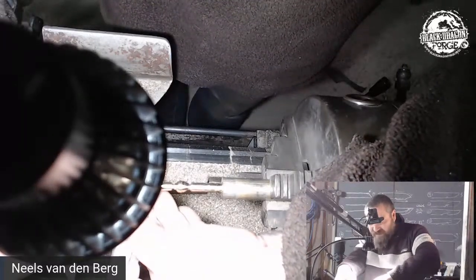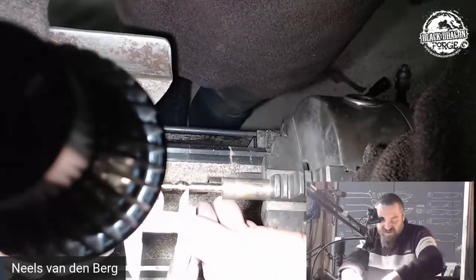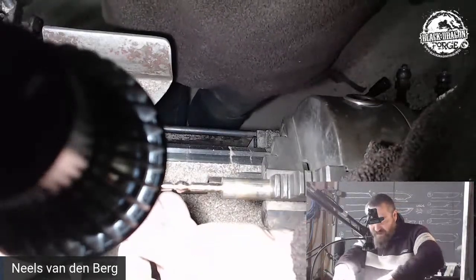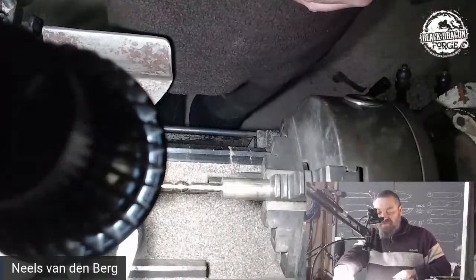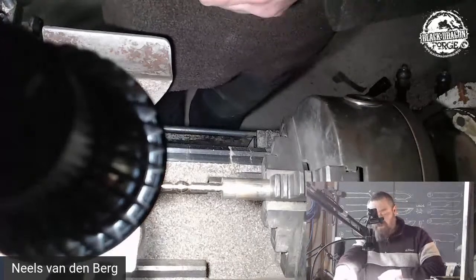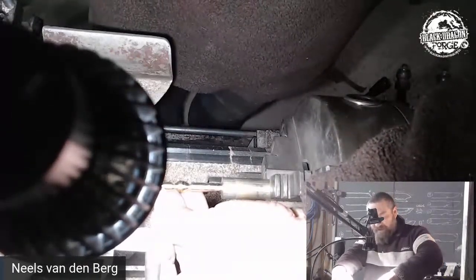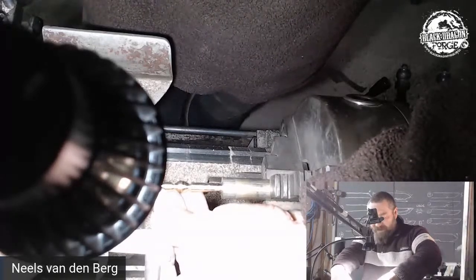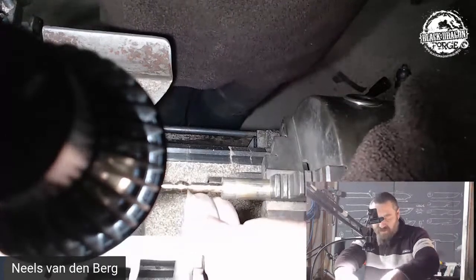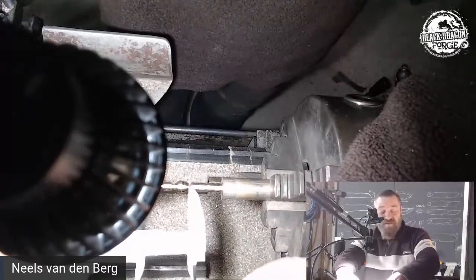So on this side, we're very, very, very close. You can actually see that the left finial, this one, might be a tad longer than the right. But you can see also, I'm now not able to get in with my vernier and actually use the proper side. So I can also use that measurement over there. So from our side of the Quillon block to there, lock it up. Same thing on there, and you can see how the left finial is longer than the right one.